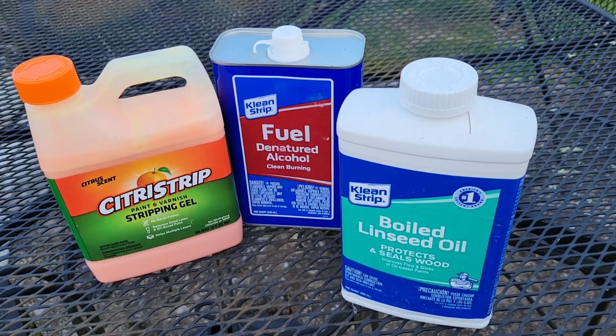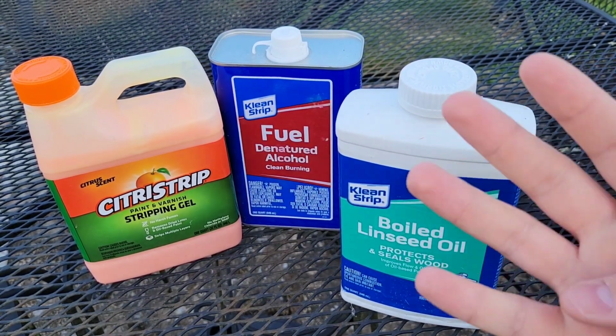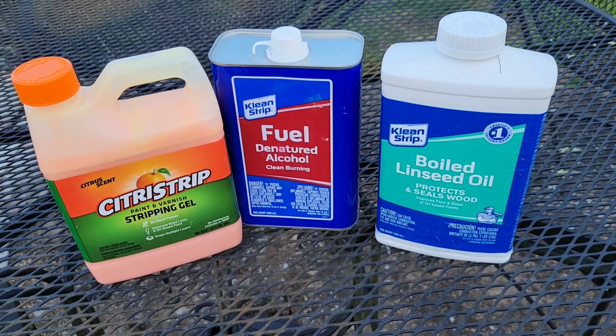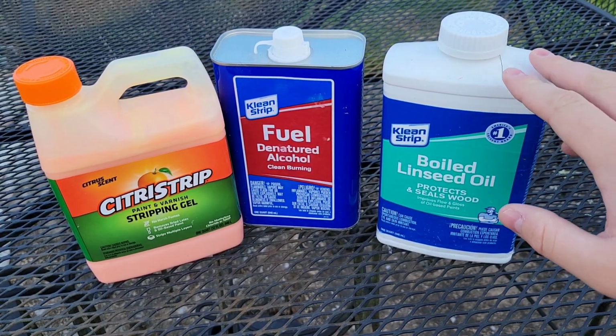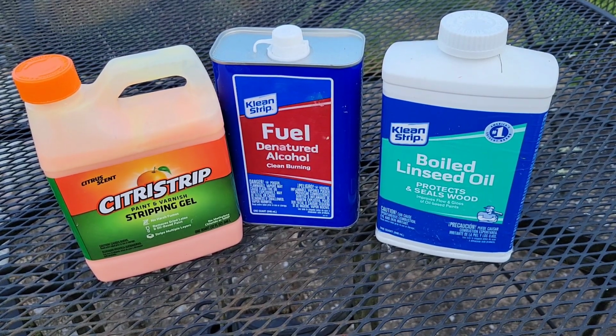I applied my first coat, rubbed it, let it dry, applied a second coat, and let it rub in. I applied a total of 4 coats of boiled linseed oil to my stock, and that completely changed the look of this carbine. It really saved the looks of this carbine, kind of restoring it back to its original look, with what the U.S. military did use at the time. I uncovered a Rockola RMC stock under that, and an OC or OGR cartouche, which I've never seen before.